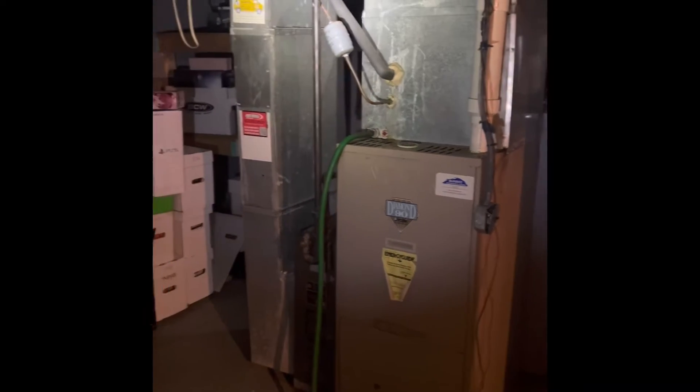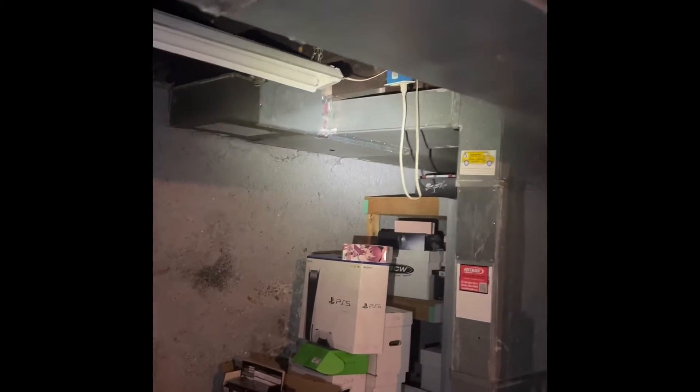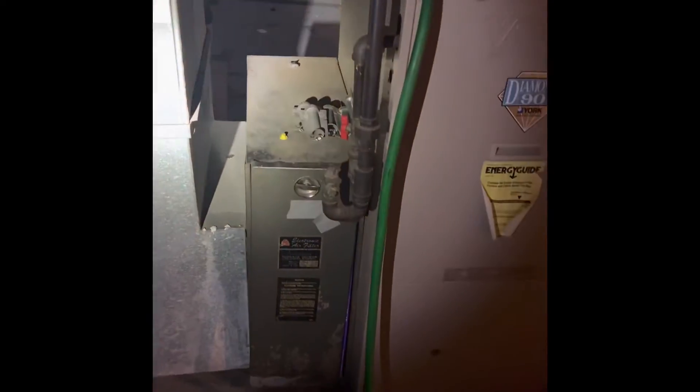New coil on top of it. The return drop would get rebuilt — I want to rebuild that entire piece there. That's a 7-inch piece of ductwork that just kind of runs and bends into the return drop. I would just put a box there — it's 52 inches from the ductwork to the side of the existing plenum. We would just build a 52 by 8 by 25 box and then do a drop straight down out of that into a new 5-inch media cabinet.